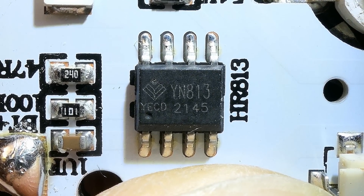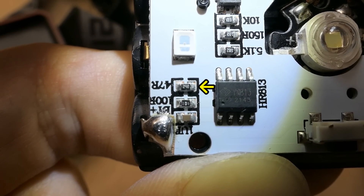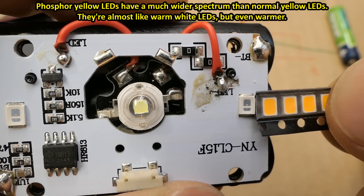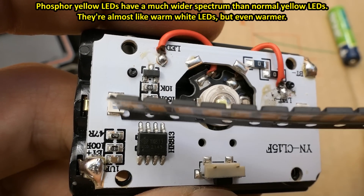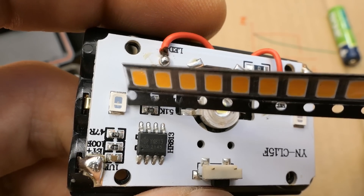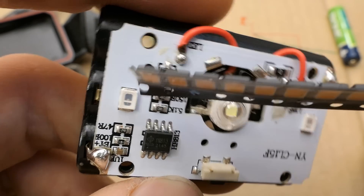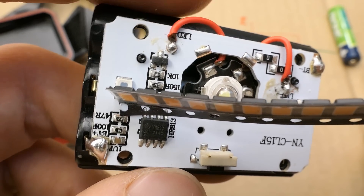The control chip even has a marking, which is a nice touch. Here's the series resistor for the red LEDs which I can modify. I have some phosphor yellow LEDs which I like — they are much more efficient than normal yellow or red LEDs. They'll be run at the rated 150 milliamps, and I'll need to modify the resistor. Even at the same current as the red ones, I'd need to reduce the resistor value because phosphor yellow LEDs drop about 3 volts versus 2 volts for red, leaving less voltage across the resistor.